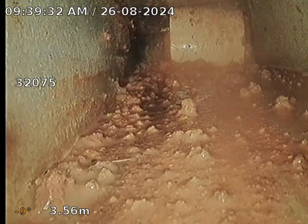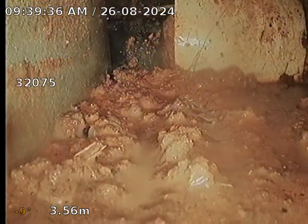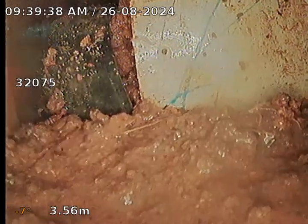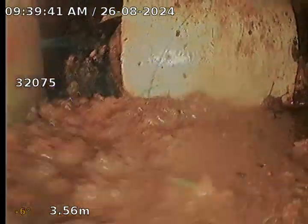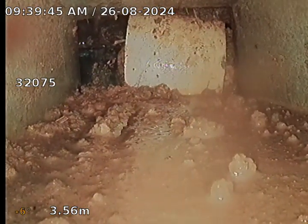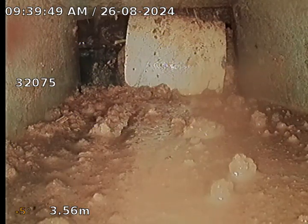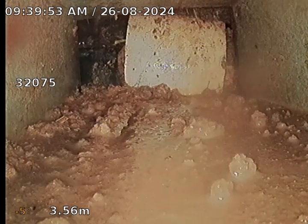We have found this intrusion right here — it appears to be PVC, a broken section of pipe. We fired up the hydrojet, pushed it through the drain, and we ended up piercing the top layer of soil and coming out through the grass, indicating a breakage within the side of the pipe somewhere.